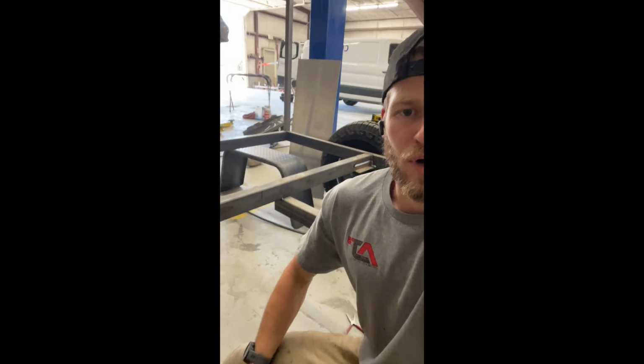So after much contemplation, I'm gonna go ahead and weld the frame of this thing all solid, not for the actual box of the trailer, but the heavy duty bottom of the trailer. I'm gonna get that all welded up so I don't have to worry about it. It can be solid, and then I can get the braces in for the wood, because I have to put at least one more brace in here to screw the wood down to in the front section. The back section should be fine.